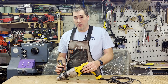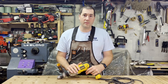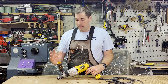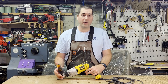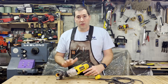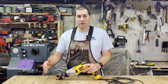One of the other nice features about this hammer drill is that it's got an adjustable handle, which is good because this thing puts out a ton of torque. That is one of the very nice things about corded tools — they have a ton of power. The cordless tools now have started to get really powerful with brushless motors, but this guy does put out a ton of power as well. It's really useful for doing things like hole saws, very large holes with a spade bit, and because it's a hammer drill, drilling in masonry, cement, and concrete.